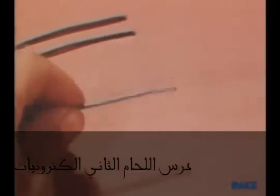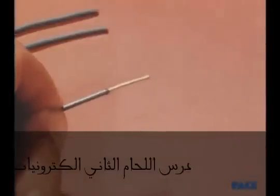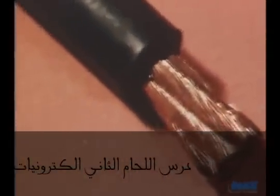The wire is inserted and held lightly, and the foot switch depressed to melt the insulation. The tool or wire is rotated as penetration occurs. The advantage of a thermal stripper is that it reduces the chances of nicking the wire, and safely removes all common types of insulation. It can be used on various types of plastic and on wires of varying thickness, including shielded cable.